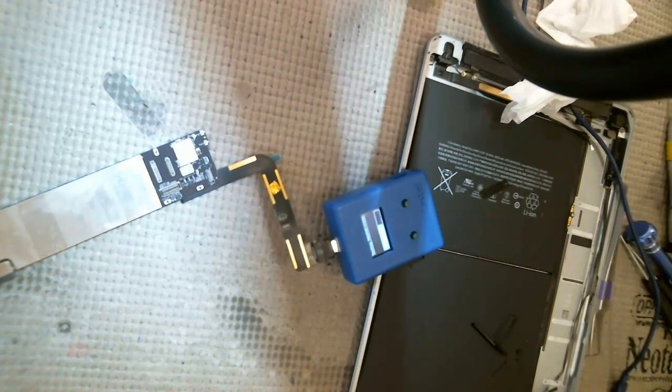The iPhone 10s, I finally did one a few weeks ago. It was a VDD main short, and I took the top layer off, put the top layer back, and it was successful. Everything worked fine. And I want to credit Jason over at STS for helping me out there a little bit. The trick is, I'll create a video on it the next time I have one.